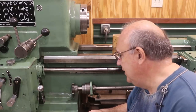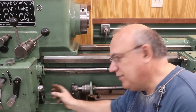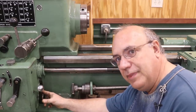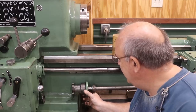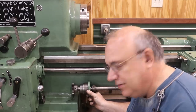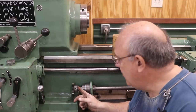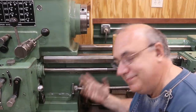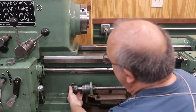After playing around with this for a few minutes, I think I figured out what's wrong. It's not wanting to go in far enough — the gear is bottoming out and it needs to go in a little bit farther. I noticed there was a little bit of play and this thing wasn't tight like it should be. Then it hit me what I had done: I had taken this gear off previously and when I put it on, I put it on backwards. It needs to go the other way — that should give me the clearance I need.